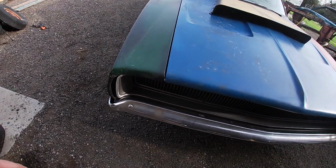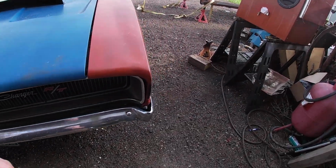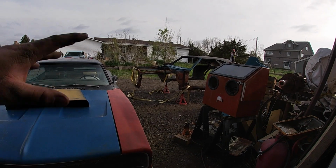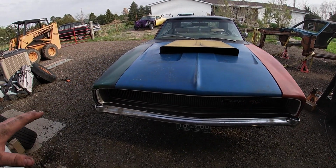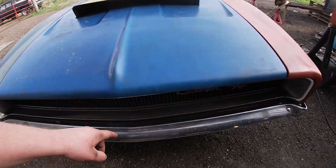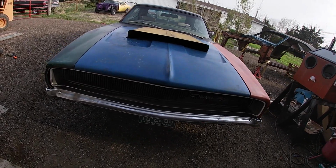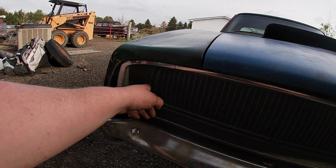And of course, these fenders on Mayhem here are trashed. This one's a little better, but it's still bad and tight. So I'm just going to go off of the grill measurements, and however the fenders line up on that, it'll probably end up looking like this. But I'm going to base them basically entirely off of these grill measurements. Once I get that main frame laid out, I can lengthen this back, and then I'll also get the center grill assembly laid out. I think I need another measurement here because it looks like this is going to be wider than the inside edge here.